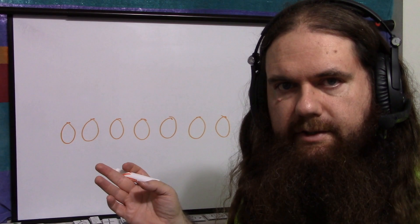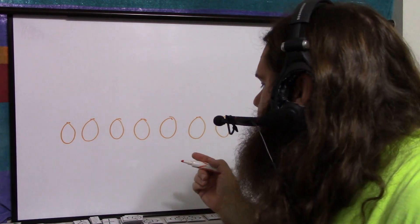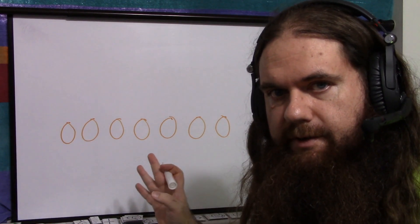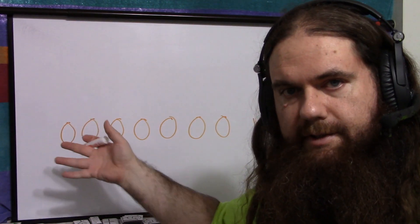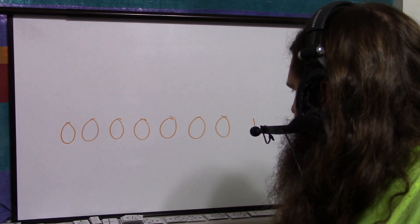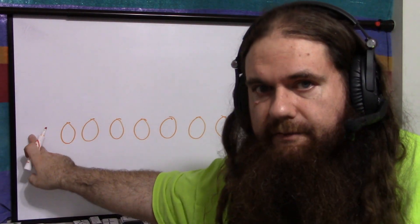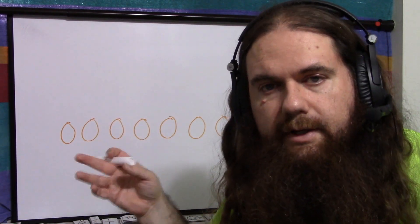When you focus on the serial aspect of a shift register — or if it doesn't have a parallel aspect — you basically shift the bits in one direction or the other. When you shift left, whatever gets put into the leftmost bit comes from a certain pin, and shifting the other way uses a different pin. If nothing is connected to those pins, they're floating and the input is garbage.